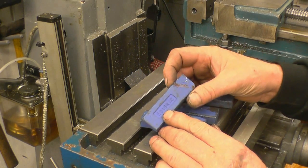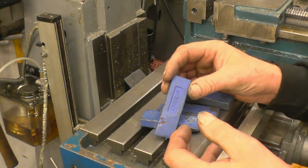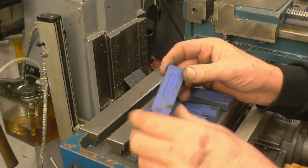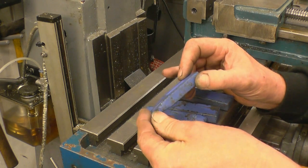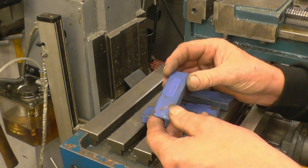I was given half a dozen brazed-on tip tools last week. They're an inch high and I need about 0.6 of an inch, so I want to take 350 thou off the bottom of them. I'll put a tip on the bottom, put it in the lathe and see what they're like. They are a really sharp tool — put a good finish on, got a nice radius on the end. For nothing, you can't go wrong.